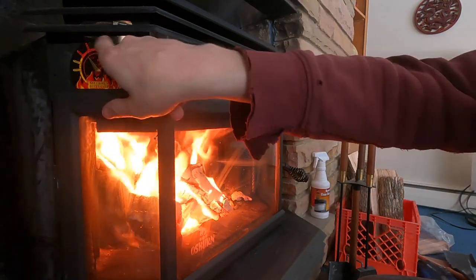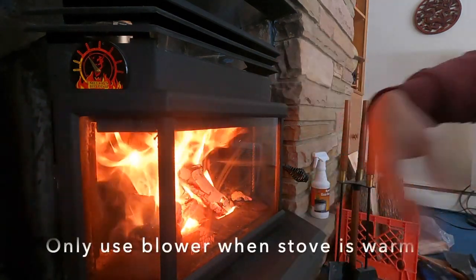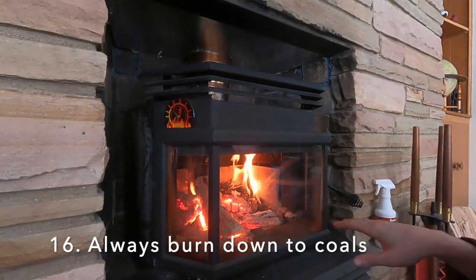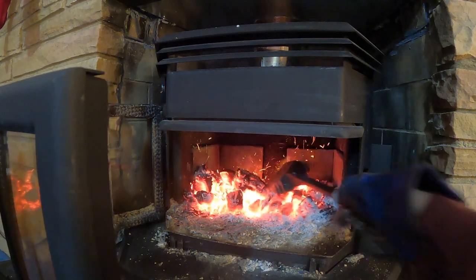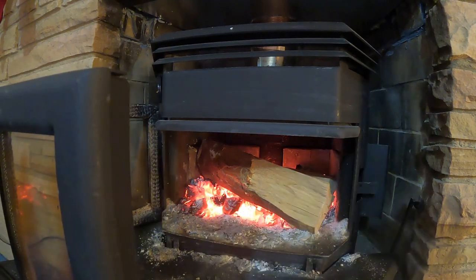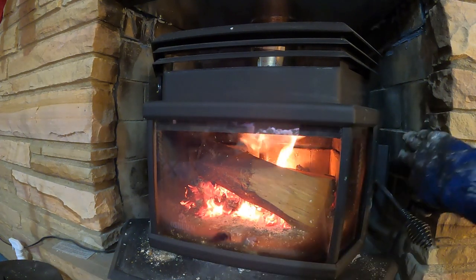About 20 minutes later the temperature is now in the optimum area. Now I'm going to start limiting the oxygen. I also have a blower down here to help push air through and heat the house. When you run the blower it will cool the insert, and if it ever gets too hot the blower should turn on automatically. To use the wood most efficiently, let it burn all the way down to coals. When reloading, I take the scooper and smash all the coals to the left and right side of the firebox leaving a valley, then throw the wood in — you get great airflow underneath and it lights up really quick.